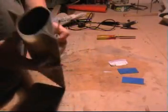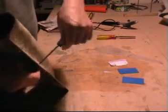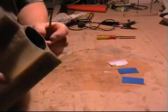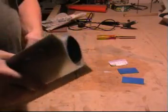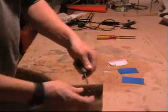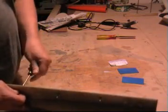Ok, giving birth — right, first thing, undo all the bolts. I forgot to mention when it was at the green stage at the toffee I just trimmed round this edge here with a sharp knife. If you time it right it just cuts like butter. Do it too early and all the glass cloth starts to pull. Too late, you can't get a knife into it.